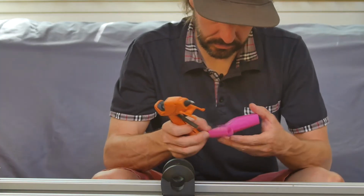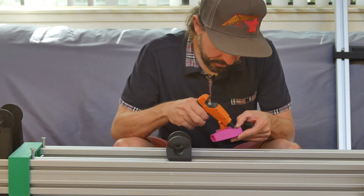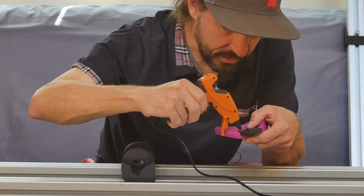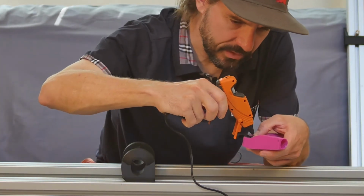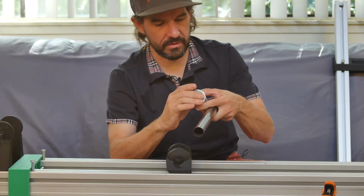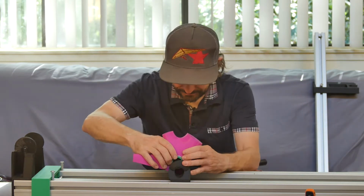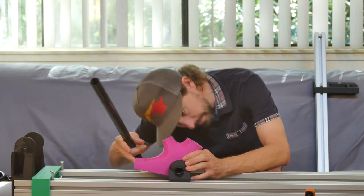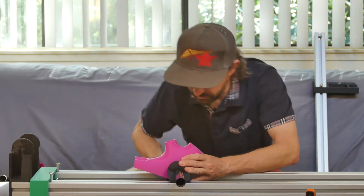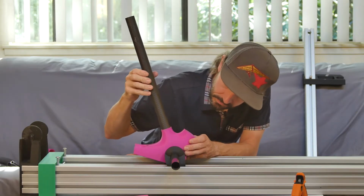The purpose for that is twofold. One, the main purpose is to ensure that the jig works properly to align the components. And the second purpose is to have it be kind of like a dress rehearsal for the final gluing procedure. The epoxy that I'll be using has a limited pot life, as all epoxies do. So I'll need to have a procedure down ahead of time. I'll rehearse so I'll know step by step what I'm going to do, when I'm going to do it, and where it's going to go.